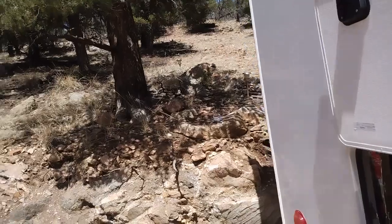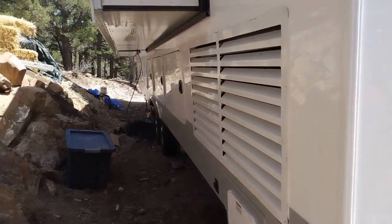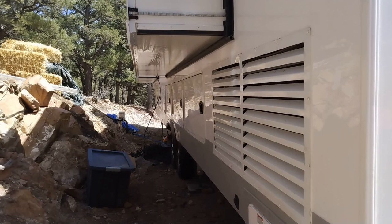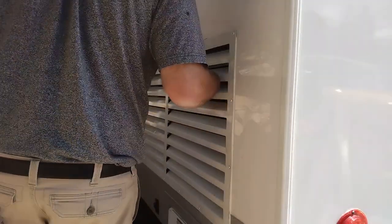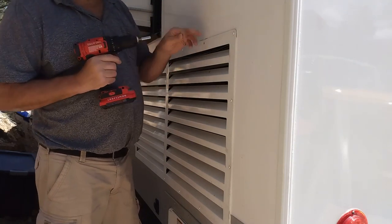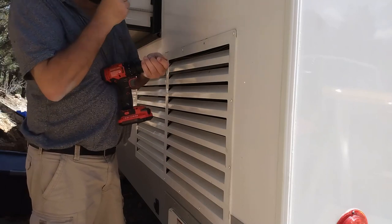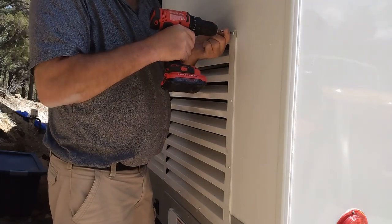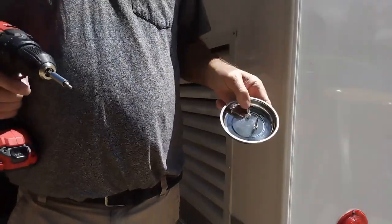I'm going to start over here. You got to take this screen off because your electrical panel where your capacitors are is on this side. Alrighty. You'll have to take this off, like I said, in order to access the electrical enclosure that has the capacitors. This is also siliconed on, so be careful when you're pulling it off, you'll bend it up real good. Get a little screwdriver.